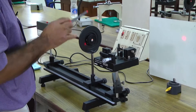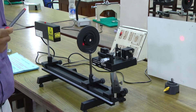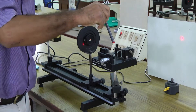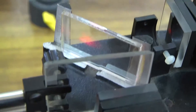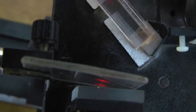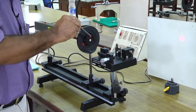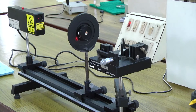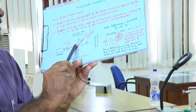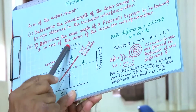This light from the extended source will fall on the beam splitter, or what we call the half-silvered glass plate. This is the half-silvered glass plate; it is set at 45 degrees with the incident laser light. So one beam will be reflected along this direction at 90 degrees, and another will transmit — as I showed in the figure.